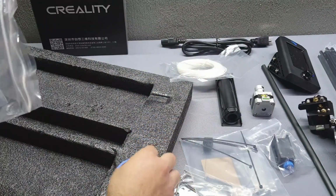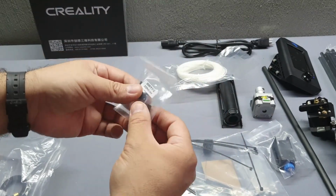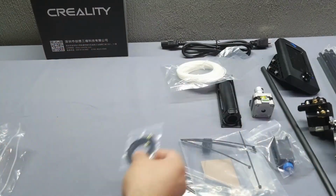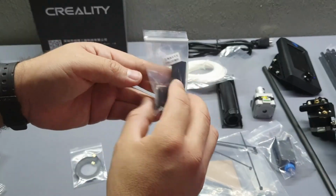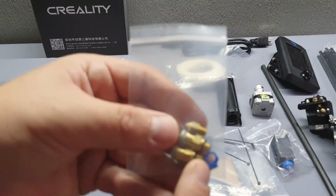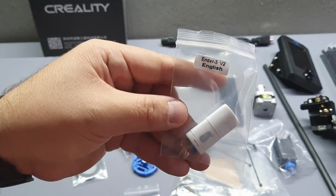With this extruder knob you can easily manipulate the filament. Plugs for the profiles of the upper frame. Band for the X-axis. Limit switch for the Z-axis. Screws and nuts included and some with surplus. Couplings for the Teflon tube and an extra 0.4 mm nozzle. Finally, a USB adapter for micro SD memories with which we load our models to be printed.